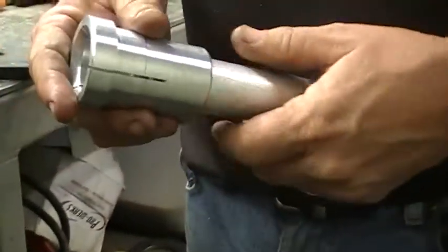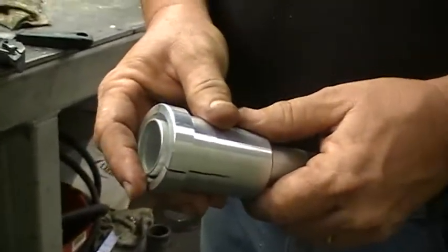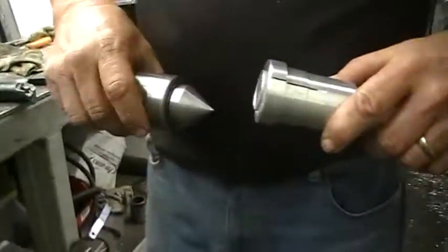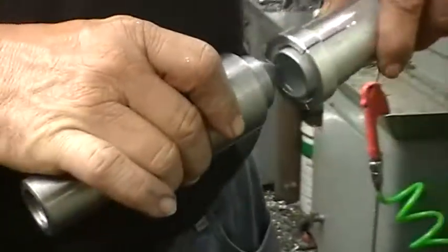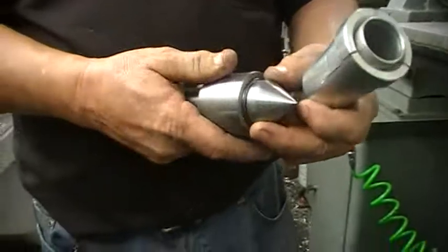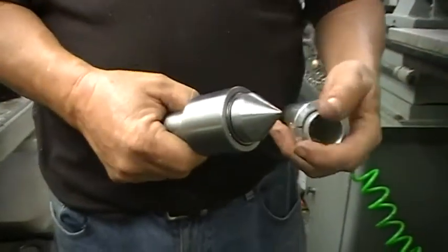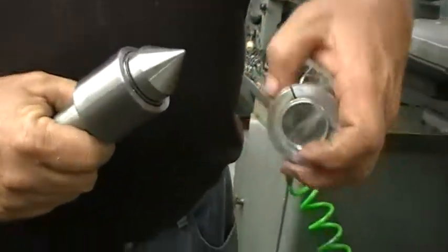We put that flange on there so it just goes up against the jaws of the chuck to self-center it. You can see we've got the 37-degree flare on the inside, and the tubing then simply slides in place. Let it stick out just a few mil — about an eighth of an inch or so — because you've got to roll it back. Then we'll chuck it in the lathe, and the other part is the flaring tool that we bring in and let it rub up against the side to push that over. This is on a bearing — just a very simple little bearing deal. We've got two bearings inside here; it's an inch and a quarter shaft that goes in one of our tool holders, and then that rotates and goes out against the flange and pushes it over.